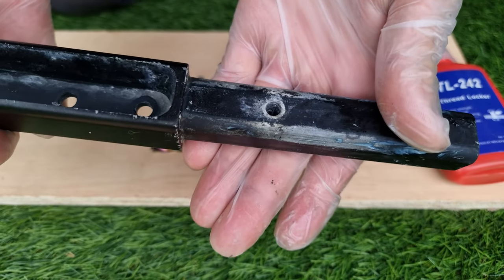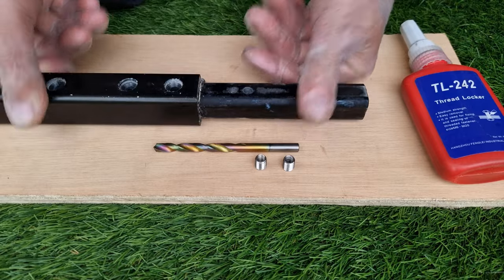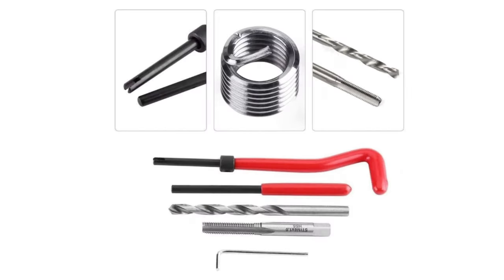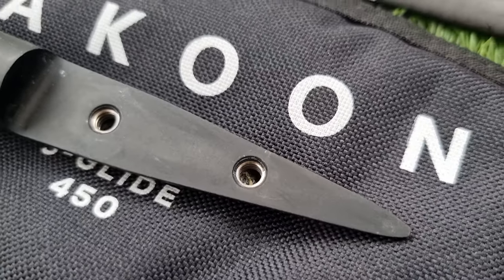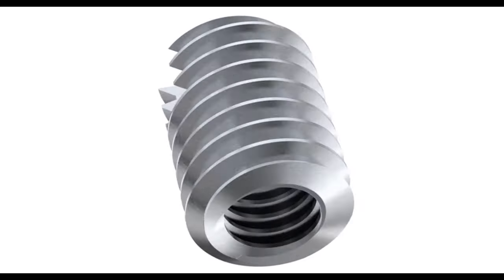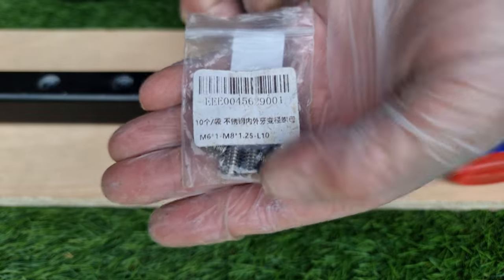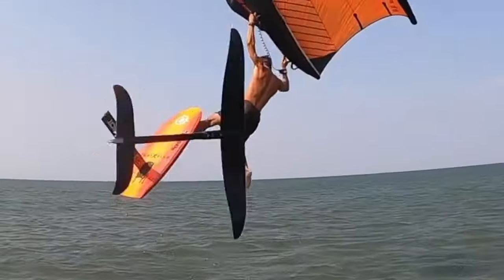So I have to either replace it or repair it. There are a few ways of doing it. The easiest one is using helicoils, and you can find quite cheap ready-to-use kits with all the tools you need. Some brands actually already use helicoils in their fuselages and don't have that problem. Another option is using self-tapping insert adapters like M8 to M6, but bear in mind that this method may not be suitable for some fuselages with thin walls as it can create a weak spot.